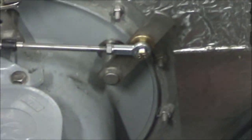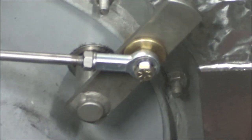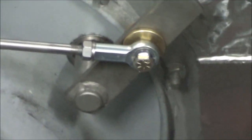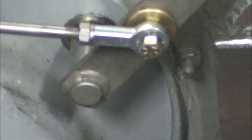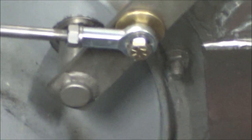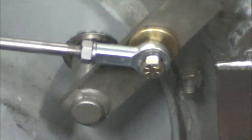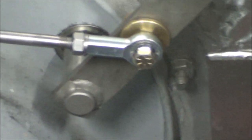And now that I've got this bearing connector here, I don't have to have that lined up perfectly. One thing I still might want to do is, I noticed online somebody mentioned that on the bolt side of this connector, you want to put a big washer. That way if the bearing actually completely fails, the washer will hold the thing together even though the bearing isn't working. So then the connector will stay on the bolt at least.